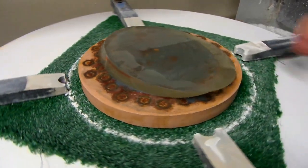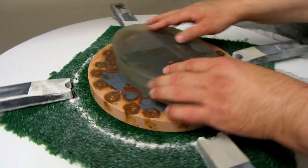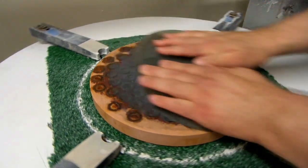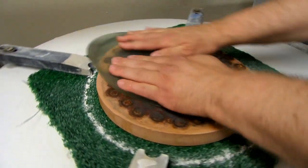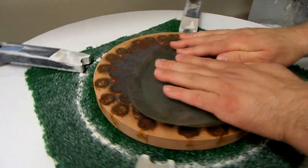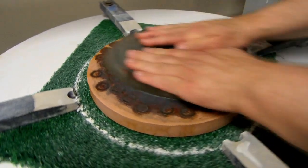I spin it up at three, four, or five RPMs, and this process — basically I just keep it within the bounds of the tool and grind away. I rotate the glass a little bit in my hands as I go, and for a flat like this, the nature of the stroke isn't too important as long as you don't get off the bounds of the tool.